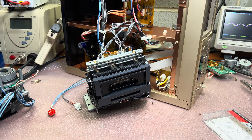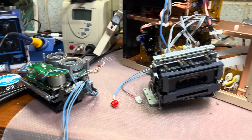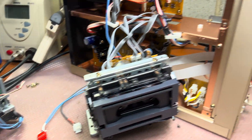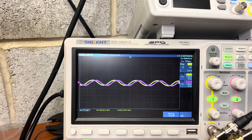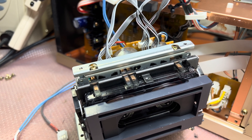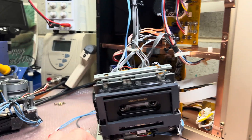My simple experiments didn't succeed. After removing the electronic boards it runs at 3,300 Hz, which is way too high. I believe the difference is in the FG coil. Let's try if it will change the frequency.